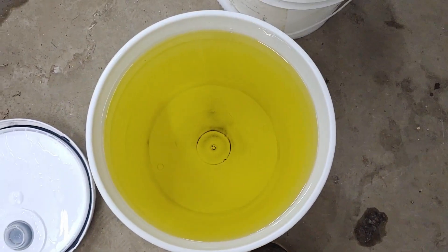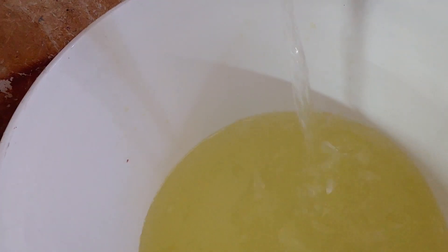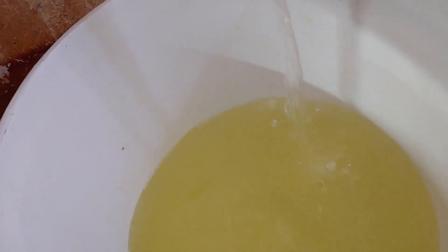Propylene glycol — it's more yellow than I expected. The water that you add to this, you don't want it to be really hard. Probably best to use soft water. It doesn't have to be reverse osmosis or anything like that, but you just don't want it to be really dirty and full of minerals. It's very important to have a funnel for this situation. We're just going to get this thing filled up — somewhere in here. This is a small reservoir, and it's just depleted until the pump didn't really have any extra fluid to push out into the loop field. The loop field could also be partly empty, so it might take more than the 4 gallons we've mixed up, but we'll see.